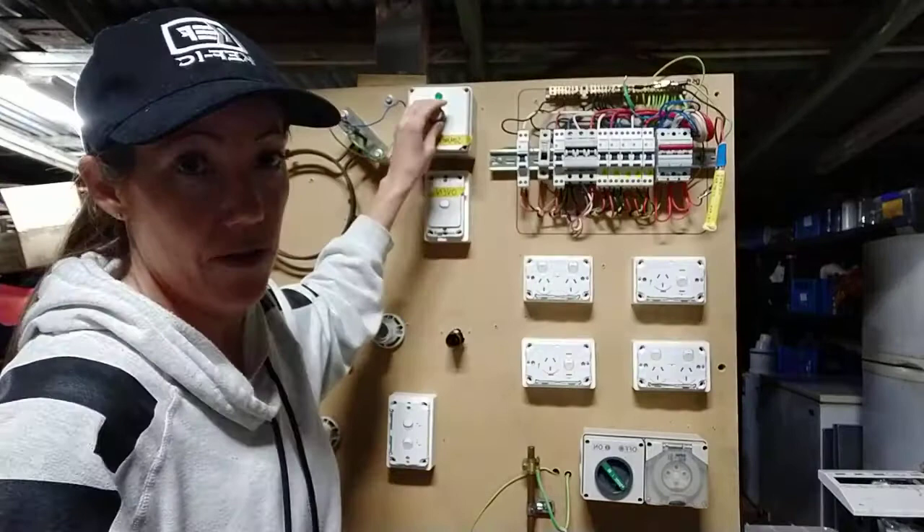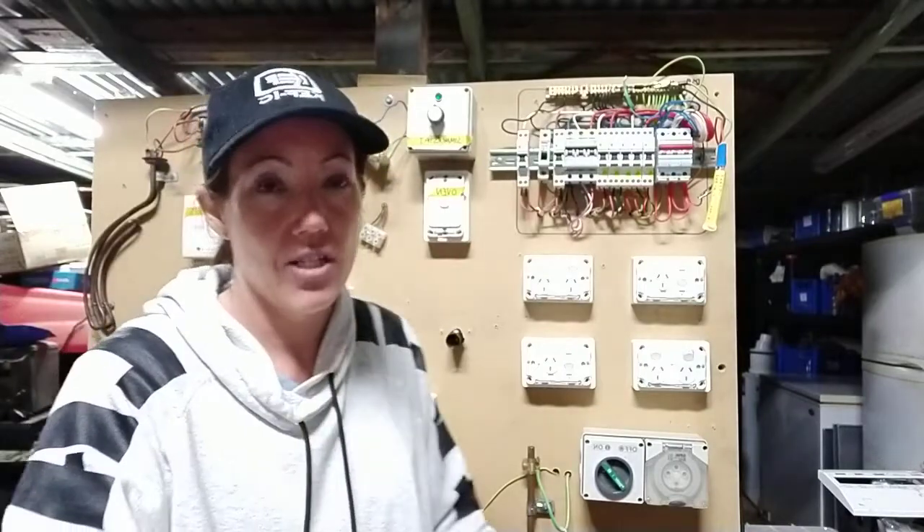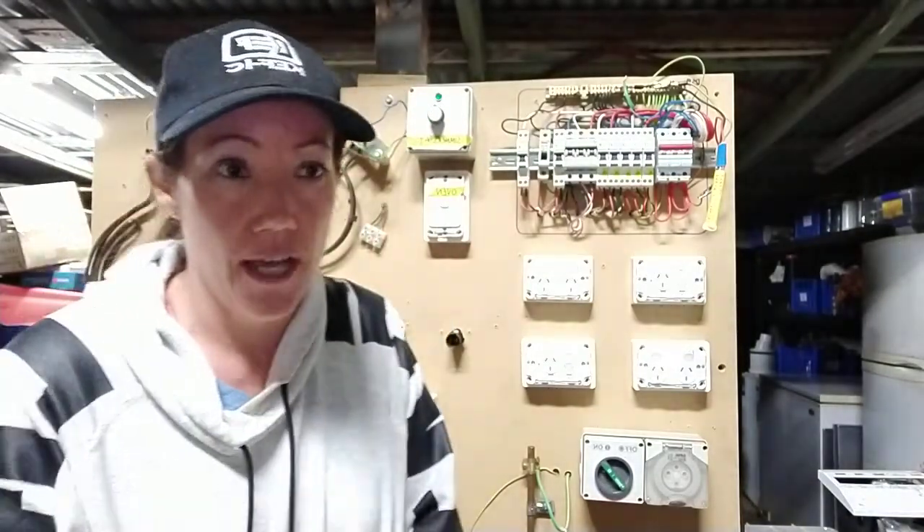You can move your thermostat around — make sure that's turning on and off and you will see a little bit of resistance change there. But basically that's polarity. V² divided by P — for a 4.8-kilowatt system you're looking at about 11 ohms; for a 2.0-kilowatt system you're looking at about 26 ohms resistance. Good luck.